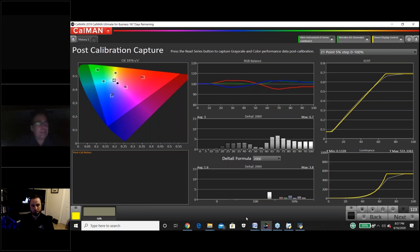What happens now is, if I get out of HDR and go back into HDR, the gamma is always going to reset to the default. Every time you do that on this model of projector, only this year's model, it was fixed in the next year's model, every time you plug the HDR source in, you're going to have to reselect custom gamma with the import. Got it. You have to remember that. You set up for your movie, but you have to do that every time you do content with this projector. Great. Good to hear. It's going to be much more pleasurable to look at.